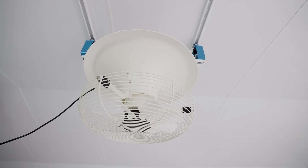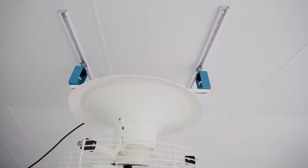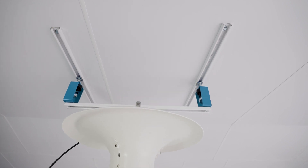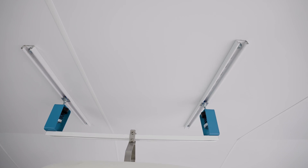It's a stratification fan which really creates massive airflow. It's quite quiet and very low vibration, but we're actually going to go one step further and put isolation dampeners to make sure that any movement from this fan is not being put into the building. We're going to start using some unistrut and some ready rod to hang this fan.